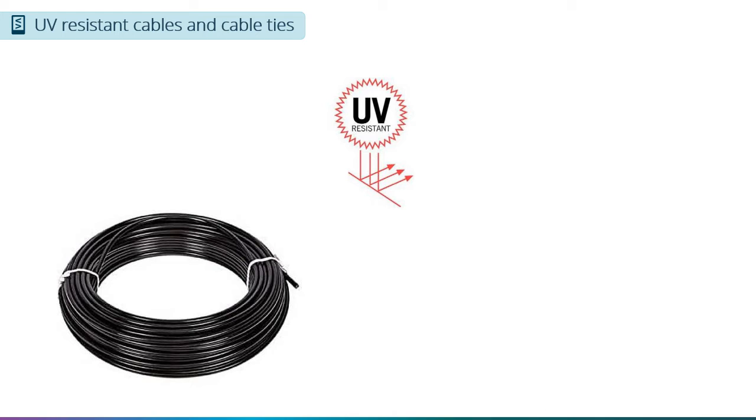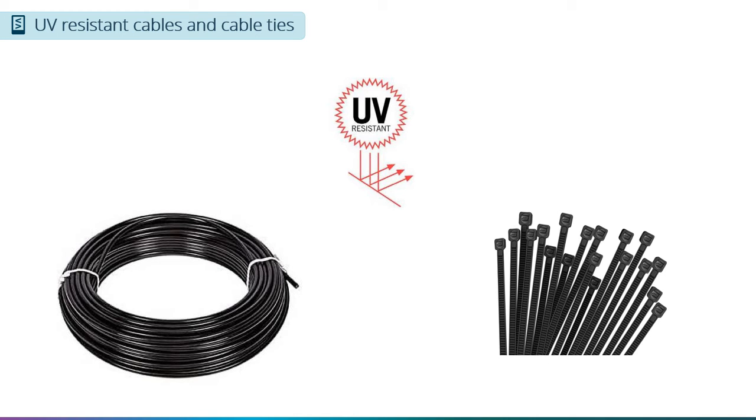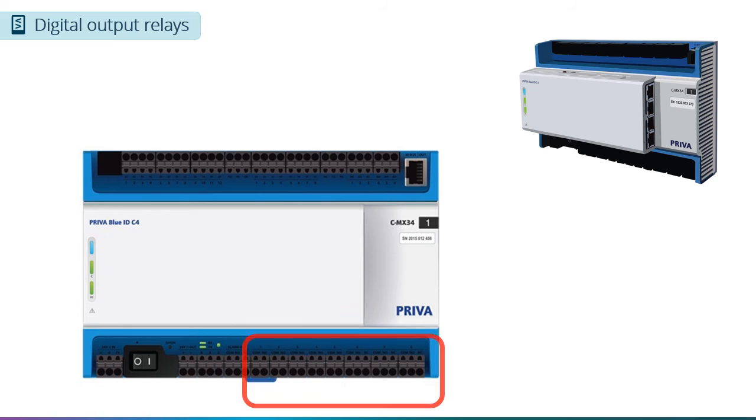While we are talking about the type of cables that you need to use, make sure you always use UV-resistant cables in the greenhouse. Also, if you are using cable ties anywhere in your installation, you also need to make sure they are UV-resistant. If you do not use UV-resistant cables and cable ties, they will break down after a few years in the sun.